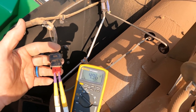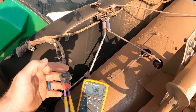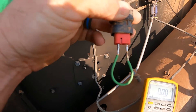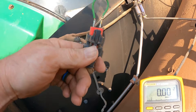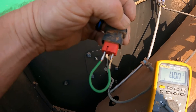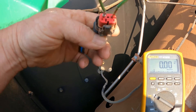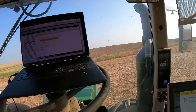We're going to check our signal return back to the ECU and monitor that in Service Advisor. I've got the connector end here with a handy little jumper wire. You can't do this on everything, but on this five-volt circuit on the differential pressure sensor you can. Typically you'd use a test box, but I don't have my test box today, so we're using this jumper wire. I've jumped pin one to pin three in the connector, and we'll look at that in Service Advisor.